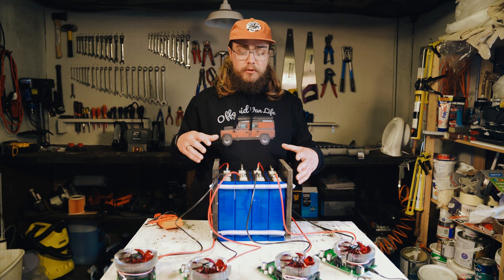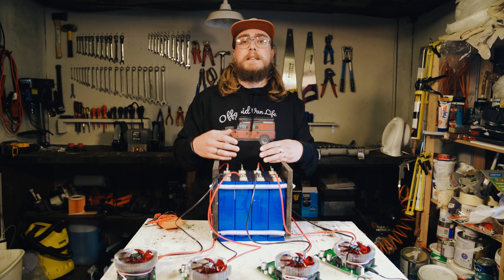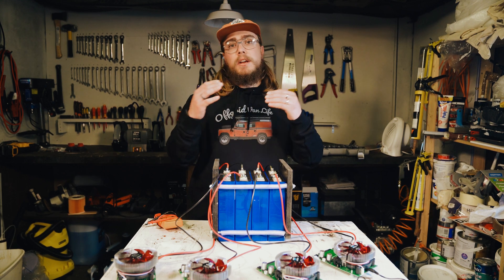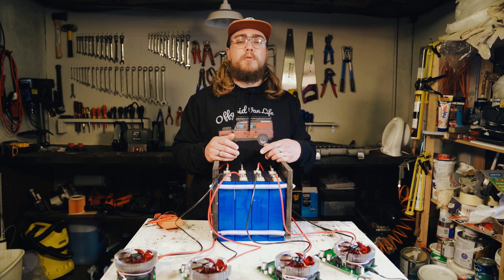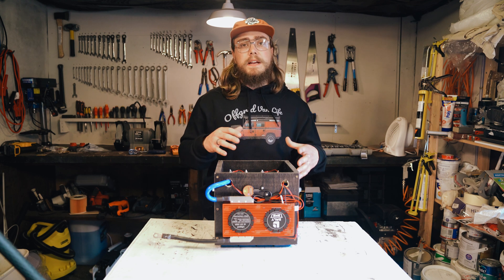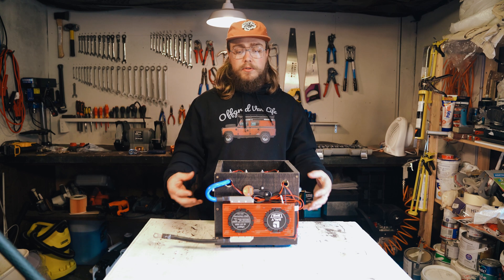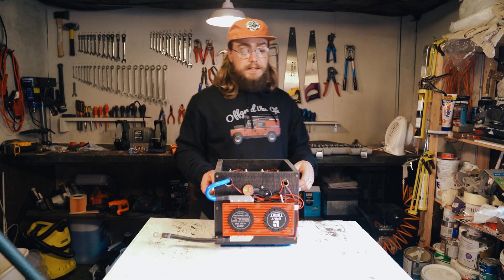Now I'm going to assemble the battery with the BMS and do a capacity test of the whole battery using the BMS as the low voltage disconnect, and see how it tests out with the BMS doing balancing. Generally speaking, you don't get much more from my experience, but we're going to do it anyway. We've got the battery built out and top balanced with the BMS on, so now we'll connect up a capacity tester and do a full assembly test.